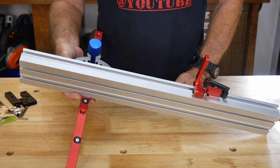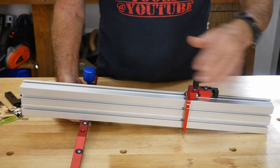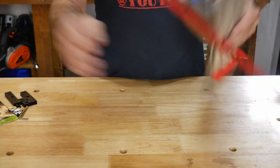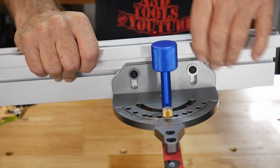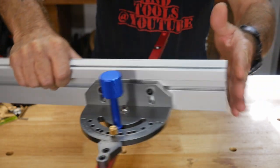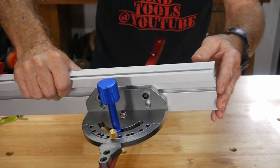The other thing is it has this really cool adjustable stop, and you can just lock it wherever you want. There's also a little finger stop — you flip it up so you don't have any stop back here if you don't need it. But when you do need it, you can put it down and cut multiple boards. You can also set this to center and then dial it in right up to wherever your blade is — bring it in a quarter of an inch or a half inch, whatever you feel comfortable with.